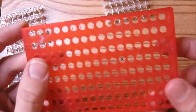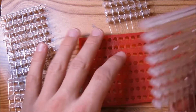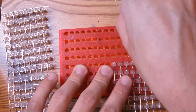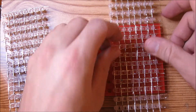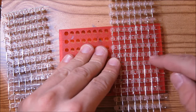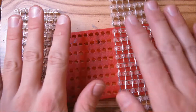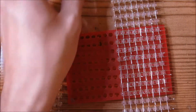In order to do that, take your jig, place it down, take your LED matrix subsection and put it in with four LEDs sticking in. Take another one and put it over to the top. We're going to solder where these two sections connect, then make one large one, and then make another one. So we have two large panels and two small ones at the end of this step.